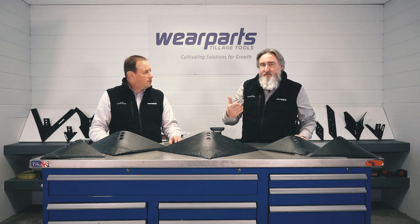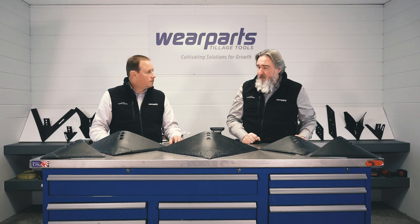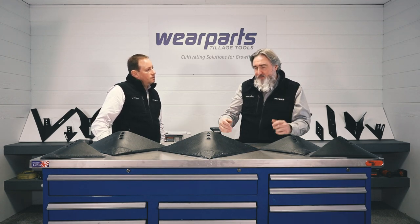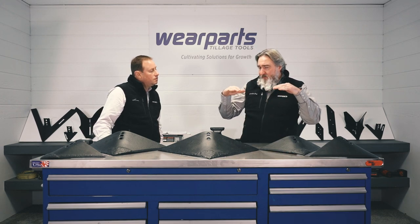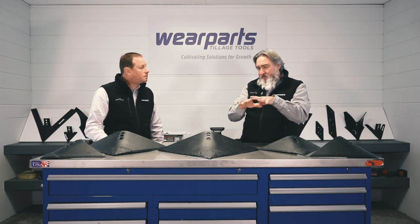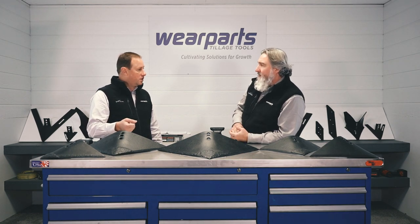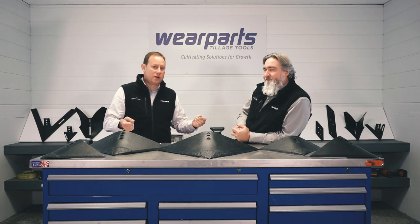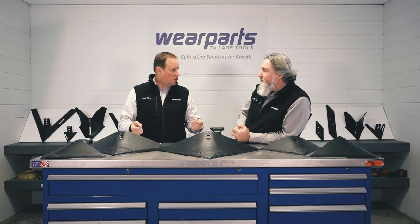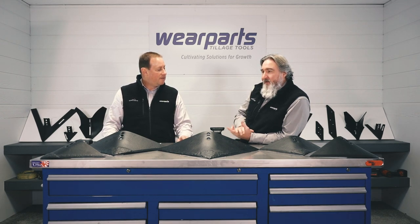So tell us just a little bit about how you oxy-fuel hard face — just the details of how that works. You're going to have a welding tip, a heating tip, that is going to be a single flame shooting out probably about three to four inches long. And you have a rod of hard metal that you're actually melting into the surface of this blade. You're not going as deep as if you were welding, but you're not as shallow as if you were brazing — so it's kind of in between. You're getting that metal to just start turning liquid on top and then incorporating that hard metal into it. You have the torch in one hand and your rod in the other. It's actually an art — some guys get really good at it and some guys struggle with it. It's actually a pretty neat process. I've always likened it to painting with fire.